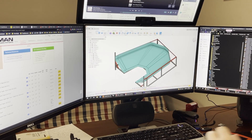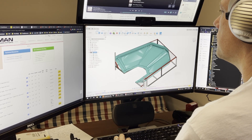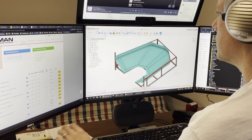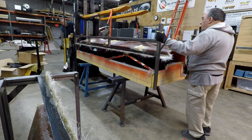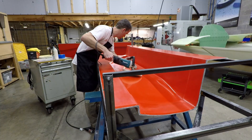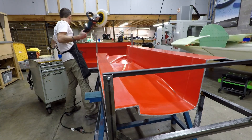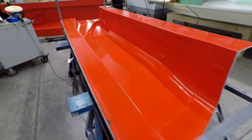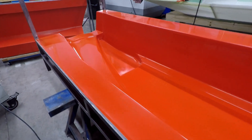To protect the mold from damage and keep it dimensionally rigid, we design a metal frame to go around it. It gets glued and fiberglassed onto the back, non-gel coated side of the mold. Once that cures, we lift it off of the plug. The outside gets trimmed, the gel coat will get a final polish, and then we apply another sealing release agent to the mold to make sure future parts will come off easily. With that step, we're done — the mold is now ready to start producing parts.